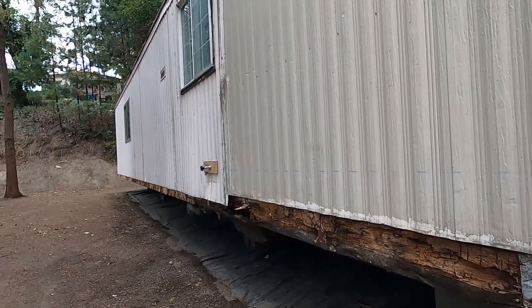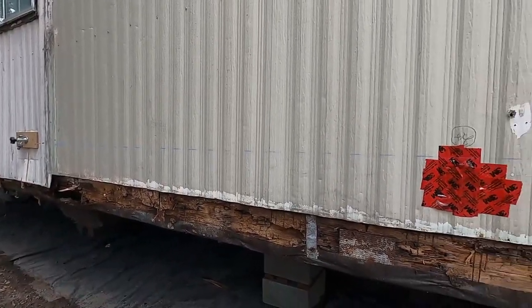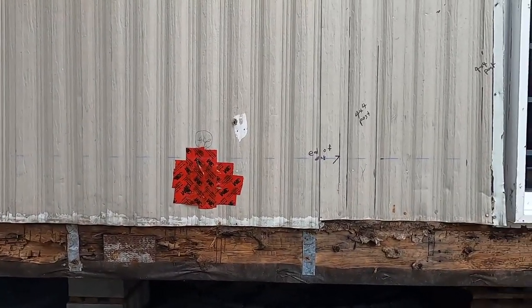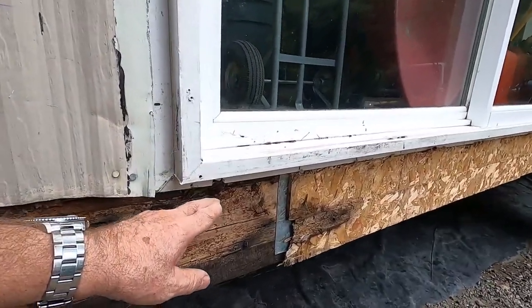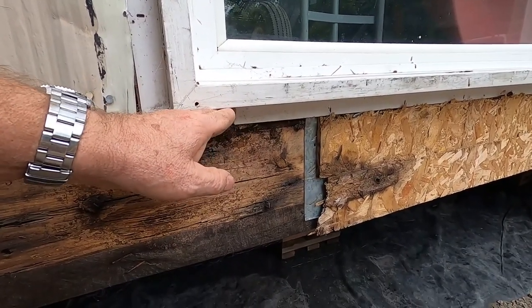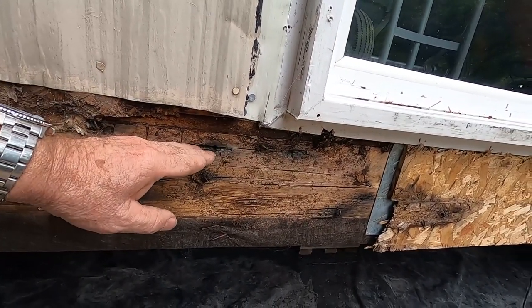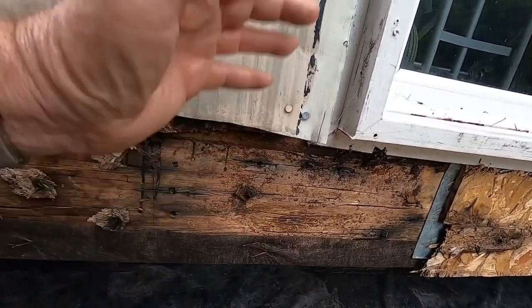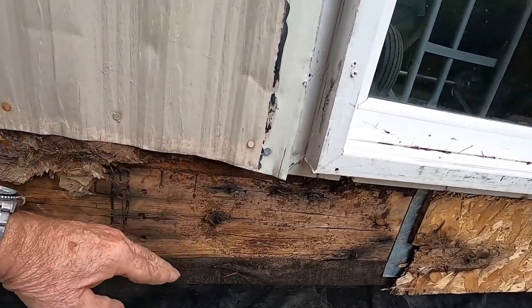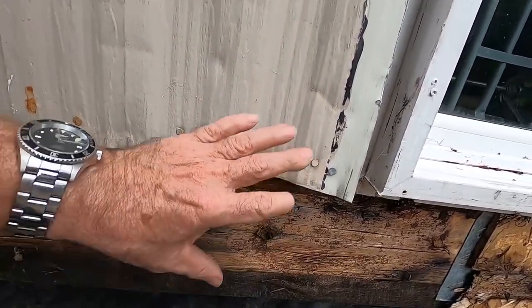For now I'm just interested in getting this repaired so I can put my new deck on. I'm still waiting on windows — another month yet — so in the interest of keeping things looking together I don't want to tear it all apart and leave it open. My new deck I always set two inches below the floor level, so my new deck top will be about here. All the flashing and membranes will come up to about here, so everything has to be good where I'm putting my new flashing.